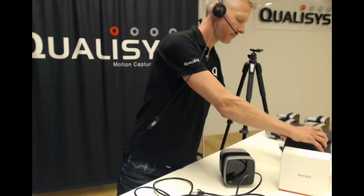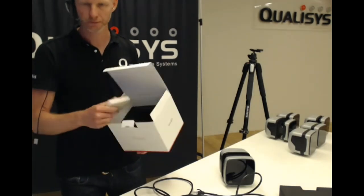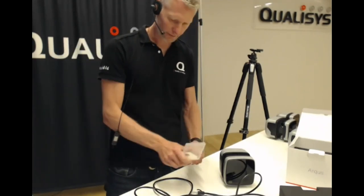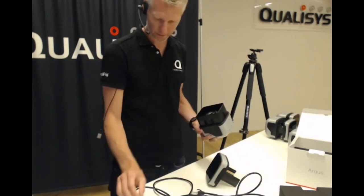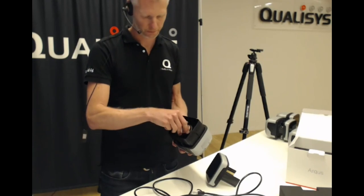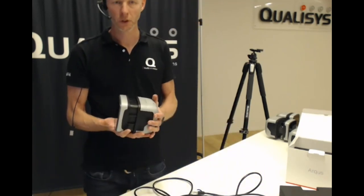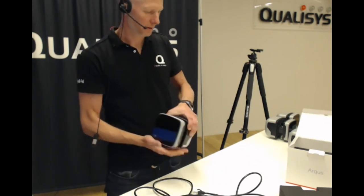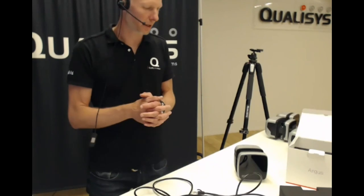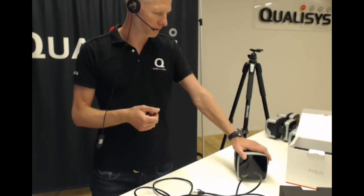Also included in the protected camera is a sun filter — it comes in the package next to the camera. To attach this, I pull the strobe out and screw the filter on to the front of the lens. The second one — quick and simple. What the sun filter does is block out the majority of light outside of the strobe range. What you do lose is something like 20% of the measurement distance and 20% of the strobe light, but it helps greatly in challenging outdoor environments.